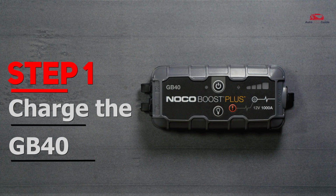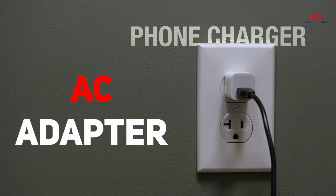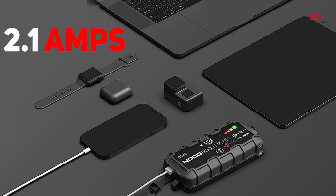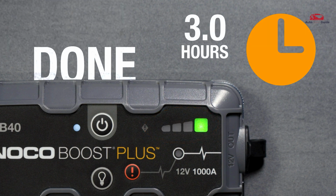Using method. Step 1. Charge the GB40. Connect the GB40 to a USB-powered port. You can charge it via an AC adapter, car charger, computer, or any 2.1 amp USB port for safe and efficient charging. The LEDs will slowly pulse on and off and become solid. A full charge will take approximately 3 hours.